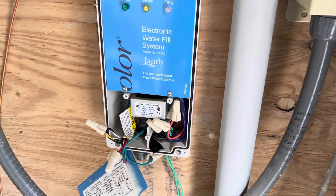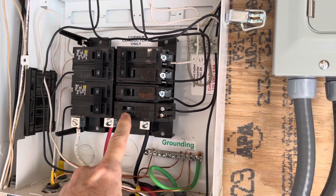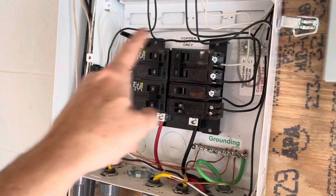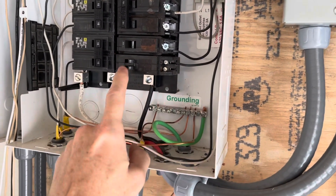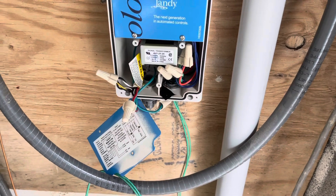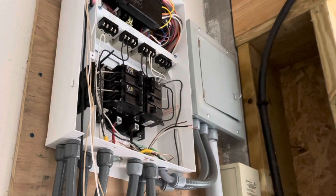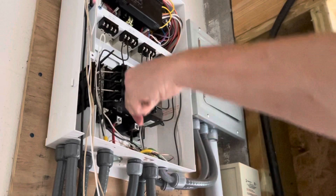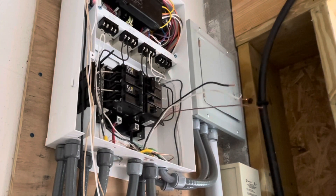This evening I've got to get power from our breaker panel, coming off this double breaker right here. I've already flipped the breaker in our sub panel so I've got this panel de-energized. It's going to come off this 15-amp breaker — the other 15-amp is for the panel power — and it'll come down through a piece of watertight conduit and go up into the box. I'm feeding my Romex up through the flexible conduit, leaving myself plenty of room because I've got to get clear up to the neutral bar on this side.